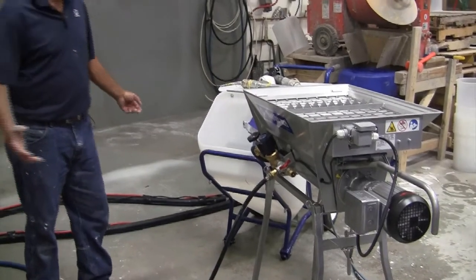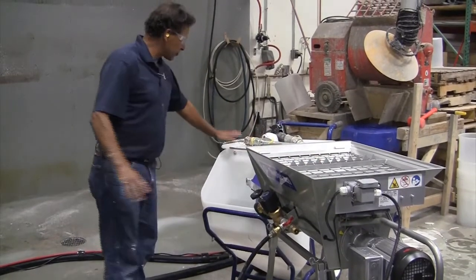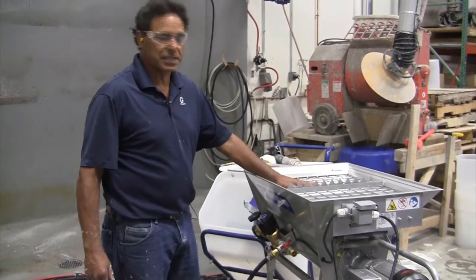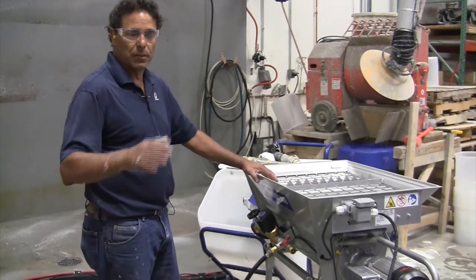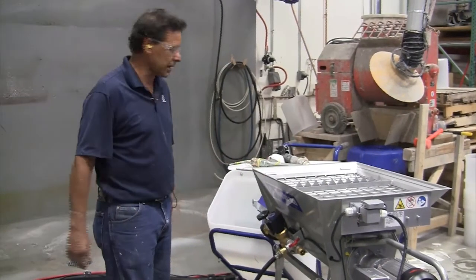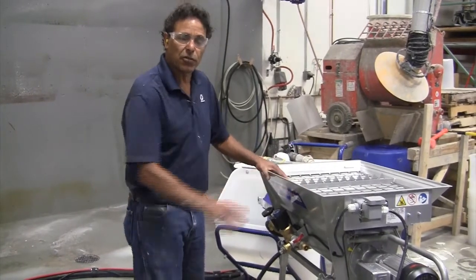What we're going to show today is a continuous mixer and the S340 stucco pump. This is innovative in the industry because this is a 110-volt setup — the pump and the mixer are both 110 volts, so you can plug them into any household current, any job current. Basically anywhere you have electricity, this machine will work.